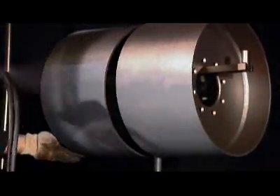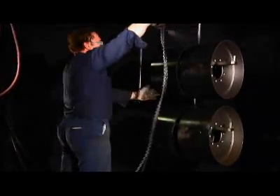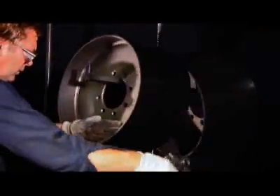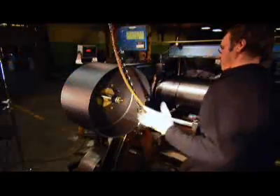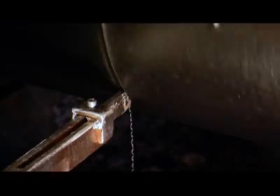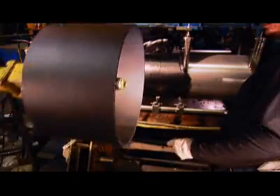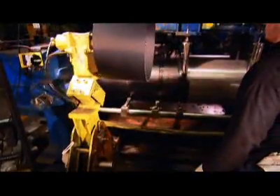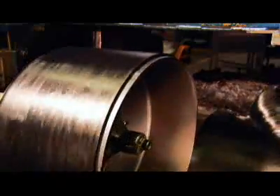Next, workers spray on a coat of primer and apply an adhesive. Then, one by one, the frames are mounted on a mechanical arm that's positioned in front of the rubber rolling system. The arm moves the tire frame forward to meet the turning cylinders. The metal surface, still tacky from the glue, easily takes up the freshly rolled rubber.